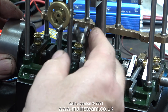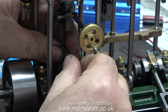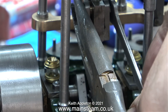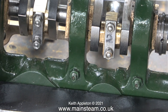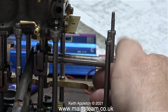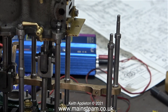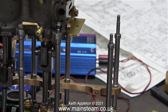It would appear that I have a bit of a problem: the middle connecting rod does not fit on the crosshead — it's not in line. But it was originally because the engine was assembled; I must have reassembled the connecting rod the wrong way around by accident. The connecting rod of the low pressure cylinder is a perfect fit — it's number two that's the problem. So I just undid everything, removed it, turned it round, refitted it followed by the pin. Please note I'm only using the pliers to hold the pin in place; I'm not putting enough pressure on with the pliers to mark the metal. I use the nut spinner to initially tighten the nut and then I use the spanner.